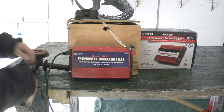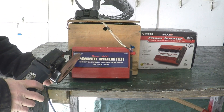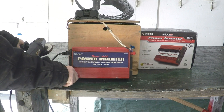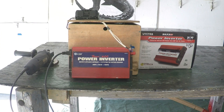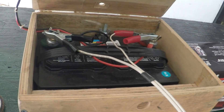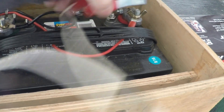I've also found it's very convenient to have a spare 600 watt inverter, because it can handle many of the small power tools you may have to operate during an emergency power outage. The wires going to the battery need to be pretty large, because you're pulling a lot of current and small wires would melt or catch fire. Placing clamps on the wiring makes this inverter extremely portable.